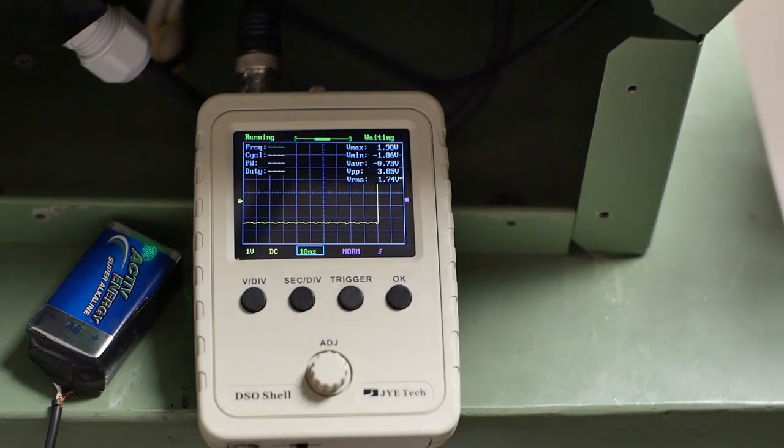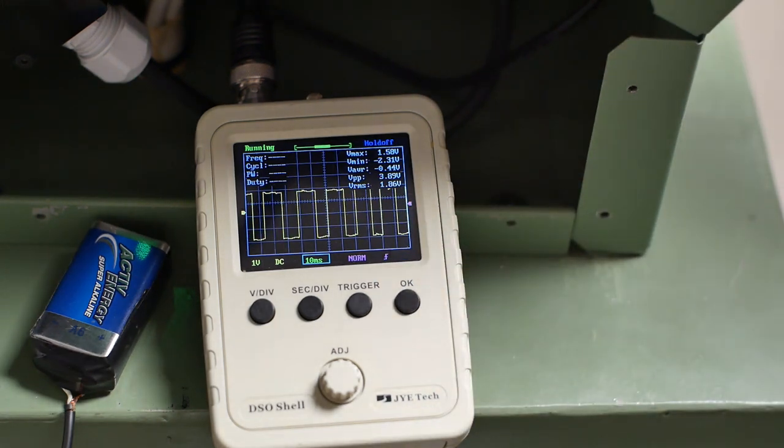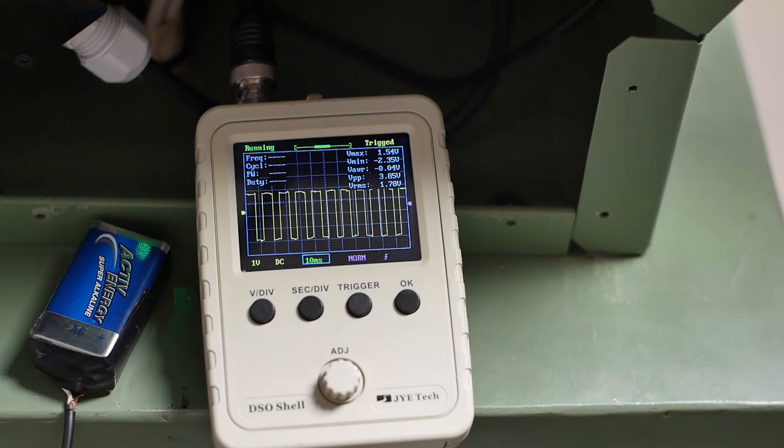And so I slept on it, and then I checked the polarity of my power supply to the jog encoder, and it was fine. So I've decided to connect my toy oscilloscope. And when I do that, I see it actually provides a pretty normal square wave like you'd expect from an encoder. I've checked it on both phase A and phase B, seemed pretty normal.